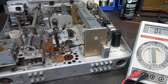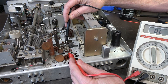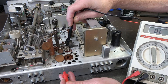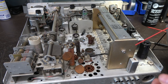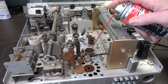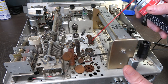Before you get too crazy, you need to take a meter and verify your work, as well as a good visual inspection. I'm going to take my meter and do some quick checks: number one, across the cap to make sure the plates aren't touching, and then chassis to either side of the cap to make sure we have no shorts to ground. Looks good. Now is a great opportunity to clean this RF section — take a little deox, especially to this 9-pin socket. Make sure everything's cool before you put it back together, because you really don't want to take it back apart.